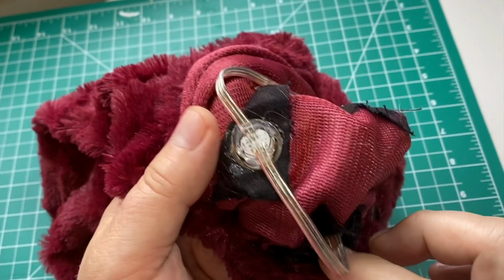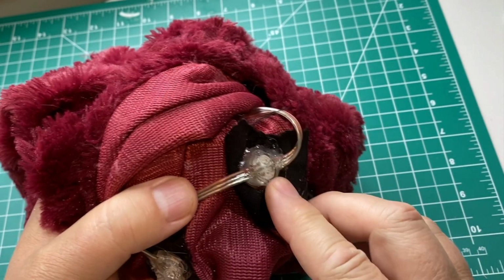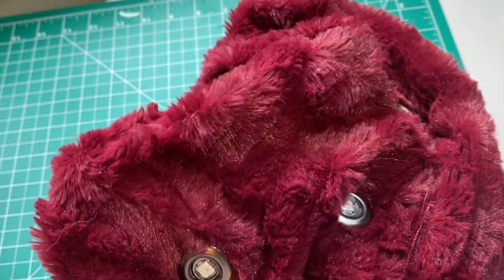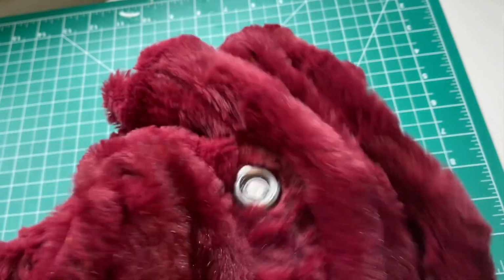Next, you'll want to hot glue each NeoPixel light to the inside of the scarf, facing out to the outside of the scarf, gluing the area around the back of the LED light to the inside of the grommet. Now the wires between the lights aren't attached to anything. 1/2-inch grommets provide a perfect size for the LED lights on a NeoPixel strand, so that when you flip them over, they're nestled in and you shouldn't see any hot glue leaking through.